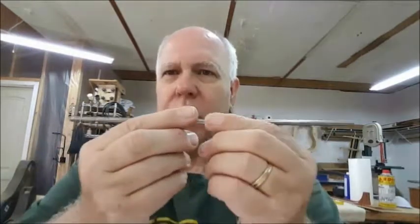Then you gently gouge that curve in. What I use to do that is just a rod — a three-sixteenths inch rod — and I file down the end of it with just a regular file, the same way that you might file off a card scraper, and sharpen the end of that rod, and then just work that rod. It works just as good as a card scraper for scraping that wood down.